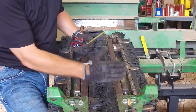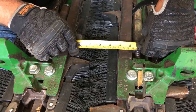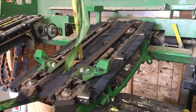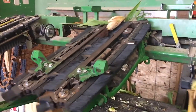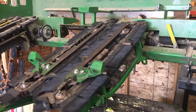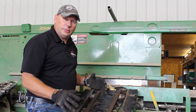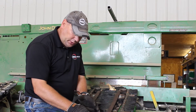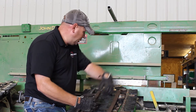With the warped guides we were well below four inches in places, but now we don't get below five inches, so this is going to make a big difference on how we come up through here. We capture the stock, start to pull down, and then we create a really good cushion as that plant works up and that ear basically gets pulled off and put up into the auger. Looking at 360 Yield Saver in that slow-motion video, you can see the way it came up, got back here, and cleanly pulled down.